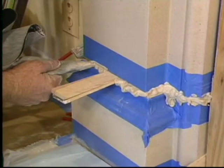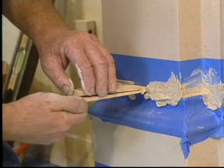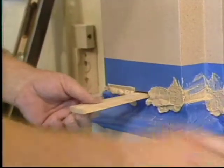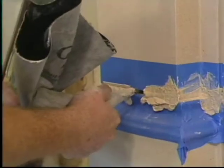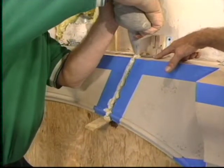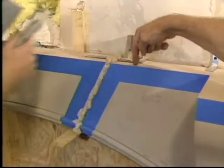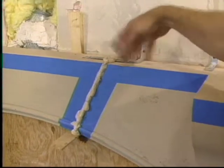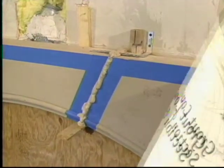If not, if you put them in dry, when you put your mortar in, it'll soak the water out of it, it'll soak it into the shim, it'll swell it up. When you pull it back out, it'll chip the stone. You'll notice right here we have used brick ties to tie this keystone to these outside 2 stones. By tying them that way, it will keep this mantle from spreading.